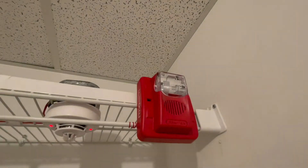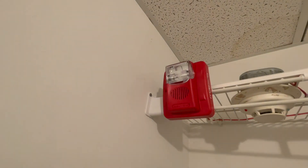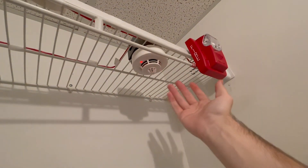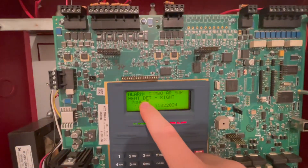If it was a fixed temperature heat detector, this thing would never work again — thankfully they don't make devices like that much anymore. I have it set as combo because this also doubles as a smoke, but in this instance it's being used as the heat detector. I have it labeled here as 'heat detector right,' meaning the right side of the setup. Now we've got both these zones in alarm.